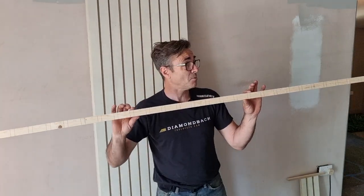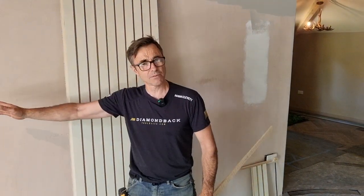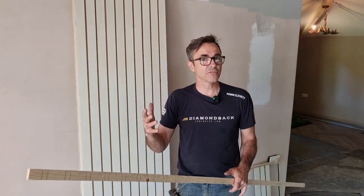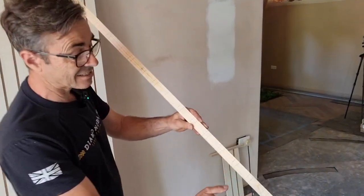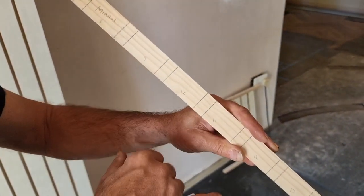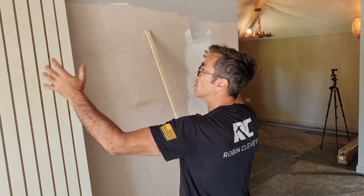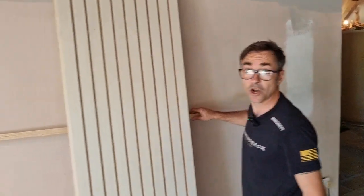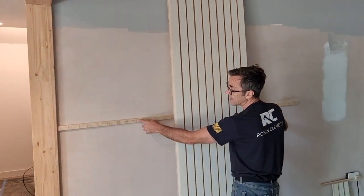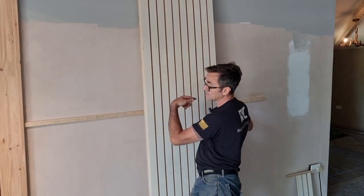It's a slatted wall we're making. This is a mock-up of the slatted wall — 50 millimetre wide slats of 15 millimetre ply. This is the Streetech; it's a poplar-faced ply and it's a fantastic birch ply alternative. The whole aim for me is finding a material as good as birch ply without many core voids, and this ticks all the boxes. It's much more available and economical, which is a big deal at the moment. Here is our rod — this is the first thing we do as a carpenter and joiner.